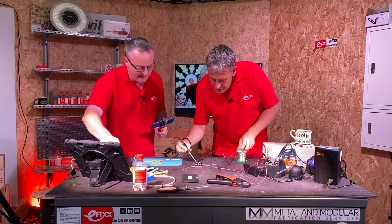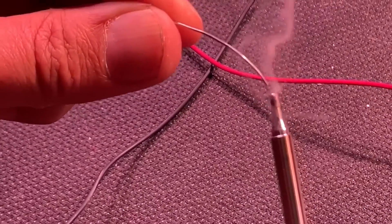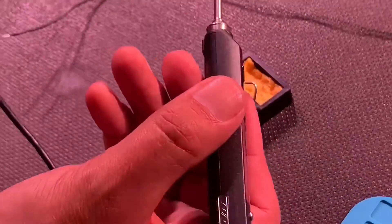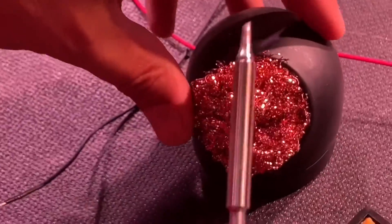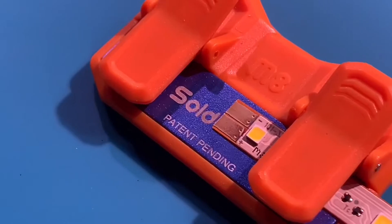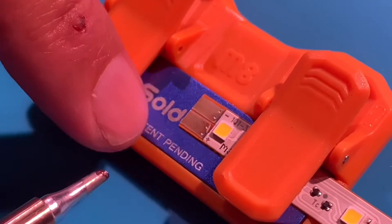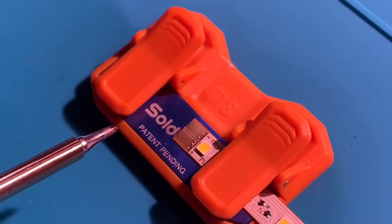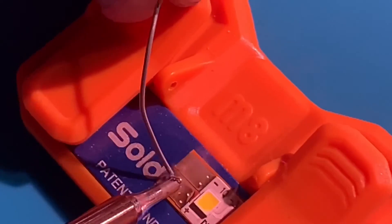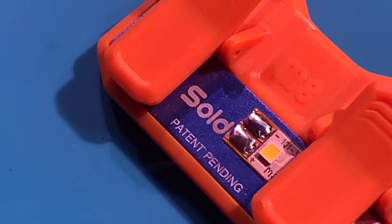So we've got some heat. Let's clean it up. Just putting in our solder. People ask us about solder as well - this is a thin gauge solder with no lead in it. You can't really have a lead solder in Europe anymore. So that melted pretty quick. I'm going to use my little Brillo pad here to clean the tip. So we've got some LED tape here on the solder mate. We like the solder mate because it holds the LED tape in place and it has a nice heat sink behind it to make sure you don't put too much heat into the plastic and melt it. So let's try and tin the pads up first. The pads on the Osram one are quite large pads - wow, that was quick. So that's tinning the pads first, and that's a technique that Osram expect people to do. You were on there less than five seconds - soldered them really quickly. And you're now ready to introduce the positive and negative conductors.